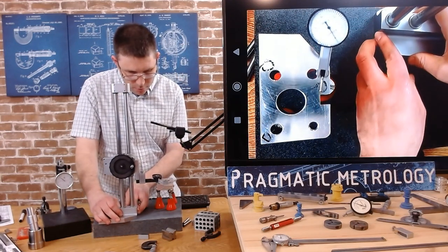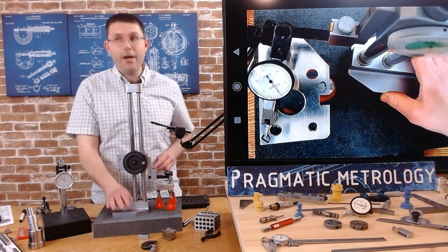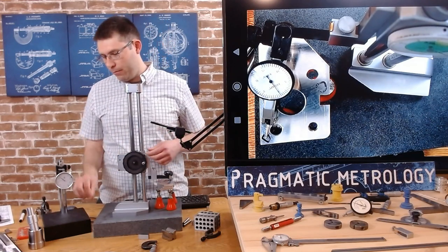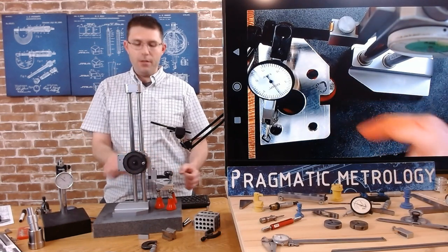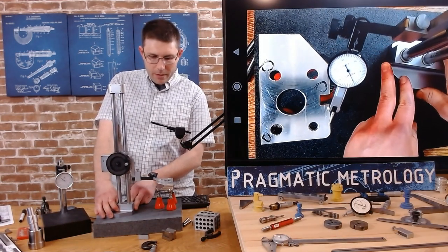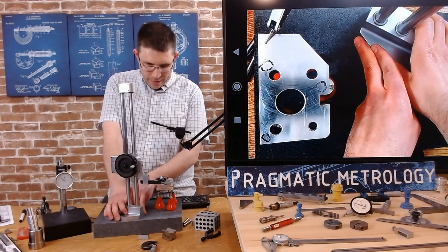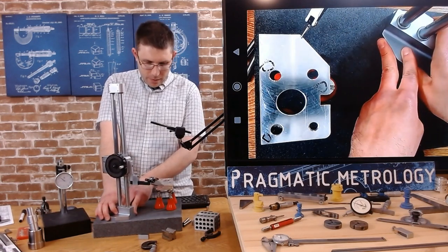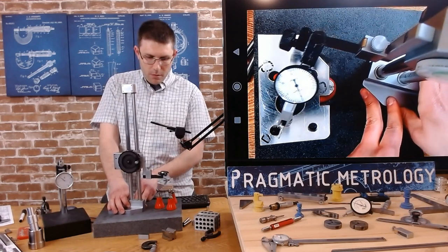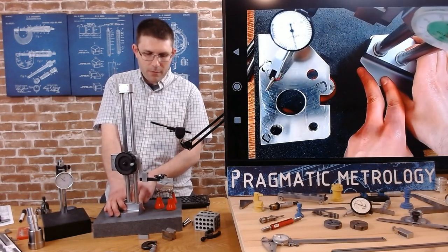I've got three zeros. Now I've got a three-point level surface relatively spread apart, and now I can check - relative to this perfect plane that I've just recreated - what is my flatness error. I'm just going to sweep all the way around. Getting a little bit of an error there, maybe a half thousandths around the hole. As I sweep outside it's going to the other direction and going a little high. Let's check our zeros again - zero, zero, zero. I might say out of everything I saw, maybe a half thousandths of wiggle in any direction. Which is pretty good.